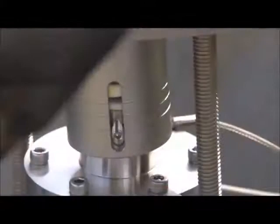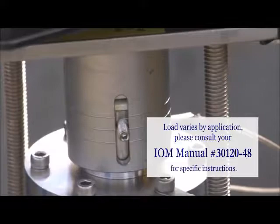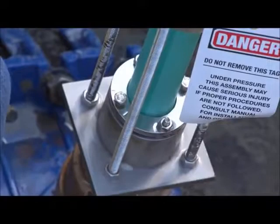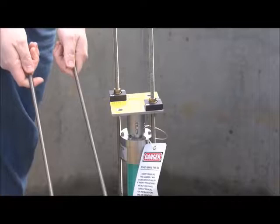Align the set screw on the top plate assembly according to the specific instructions presented for your meter's configuration, referenced in IOM manual number 3012048. Tighten the four bolts on the compression seal assembly just enough to stop any water from leaking. After the sensor has been inserted and load adjusted, the shorter retaining rods can be installed and the longer rods removed so the sensor will fit compactly in the installation site.